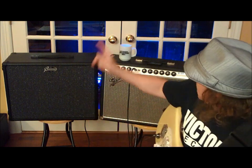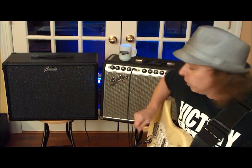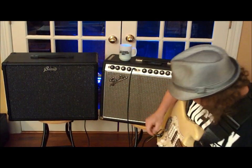Okay, so talk about lightweight. In the Burris cabinet, I have now put that vintage 1960, whatever it was, I think it might be 1960 Jensen P12Q. It's an Alnico speaker, little itty-bitty Alnico magnet. I forget what the Qs are rated, I think it's 25 watts, so just barely enough to keep up with this. That is one of the speakers that did appear in a bunch of Deluxes from time to time, when Leo happened to get a deal on some Jensens. And it is Alnico. It's a vintage speaker. They sell for a lot of money on the used market. So we've got the stock 67 Oxford here in the Deluxe, and over here, we've got the vintage Jensen Alnico.